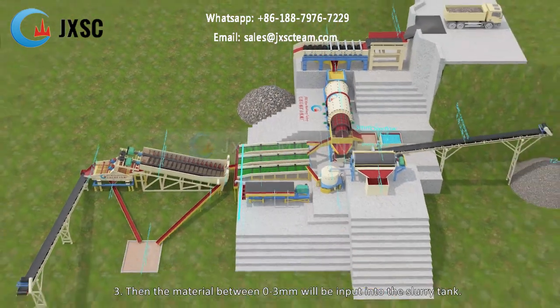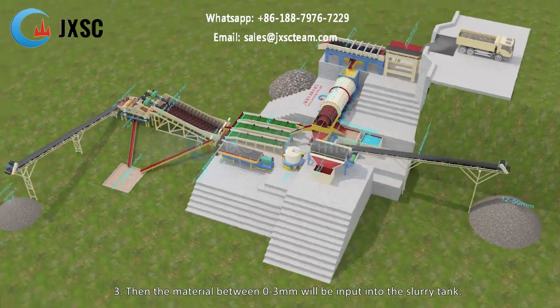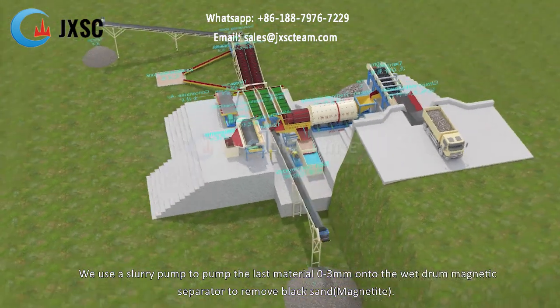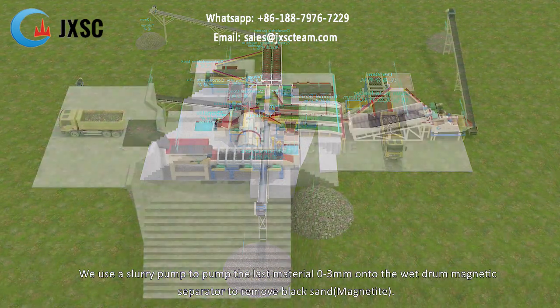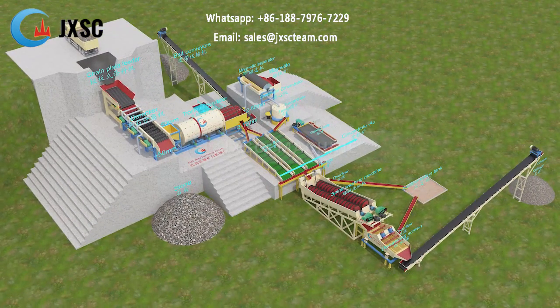3. Then the material between 0 and 3 mm will be input into the slurry tank. We use a slurry pump to pump the 0 to 3 mm material onto the wet drum magnetic separator to remove black sand, magnetite.